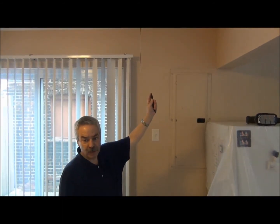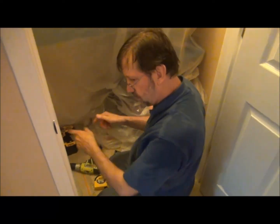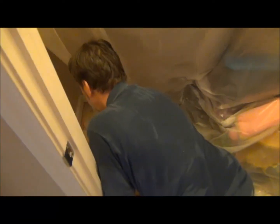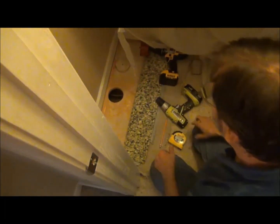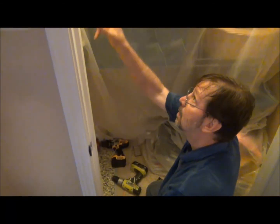We're going to patch up the little quarter inch hole we created with the first pilot hole. Basically, I have to have enough space for two tubes to go through. But before I do that, I have to get through the ceiling too, so I want to make sure — see how that aligns. I'm going to need a ladder to get up to that. We're pushing our coat hanger in to see how we look for clearance in the attic.